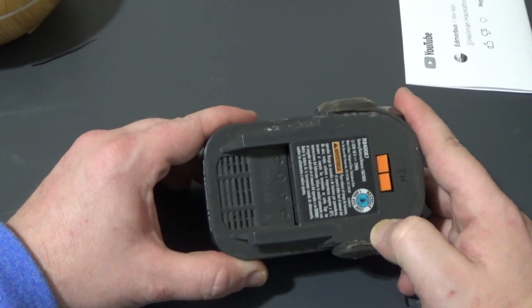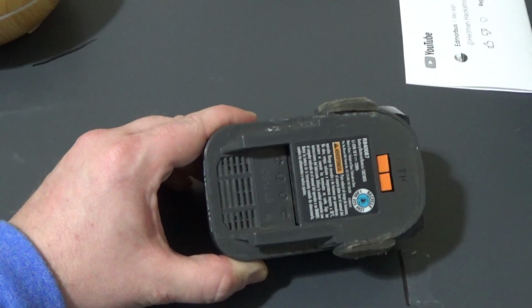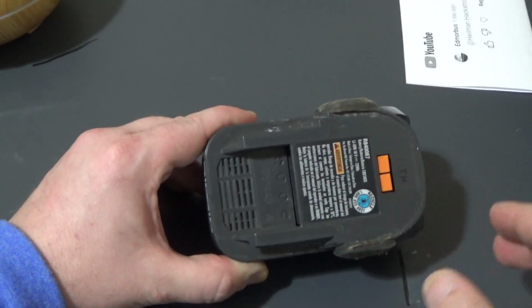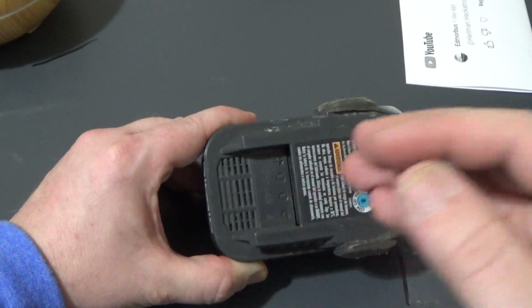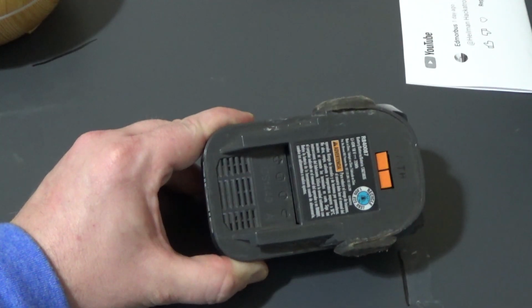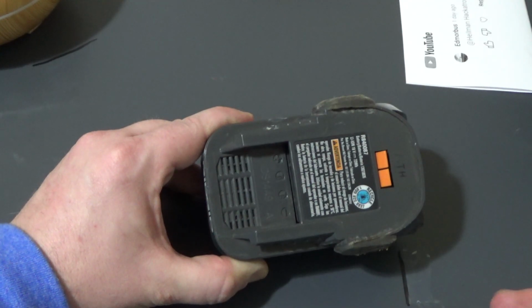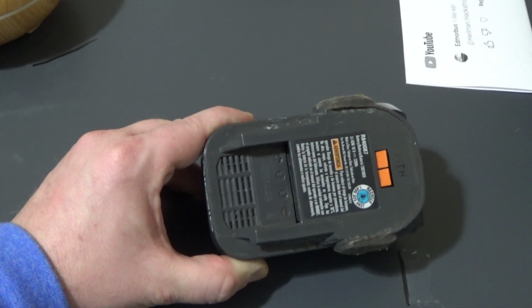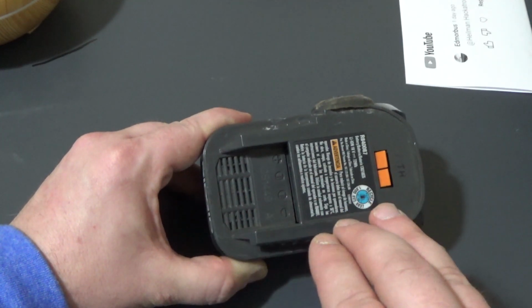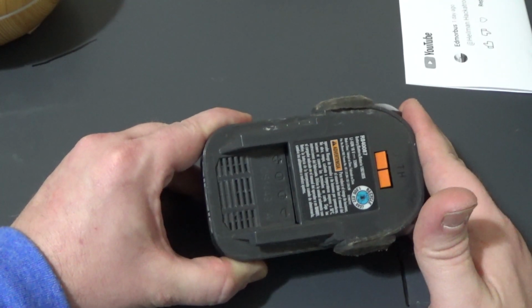And as my second alternate power supply, I will be using a lithium-ion battery, which is designed for a power tool. Its maximum voltage output is 20 volts DC, but I thought it was appropriate to use this because it is a DC source, so it will act as a linear power supply. There won't be any switching noise that you would see with the TacLife or the original power supply. So this should be a flat voltage and you won't see any kind of noise generated by the power source itself. Alright, let's get going.